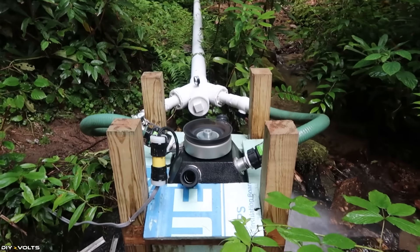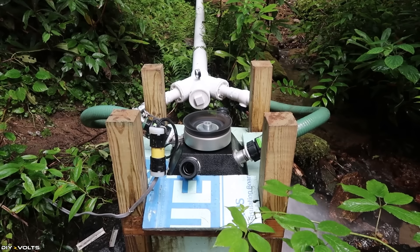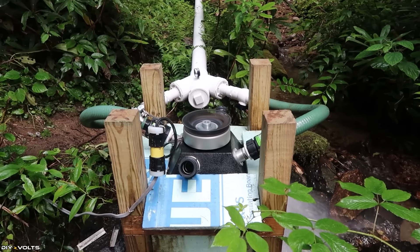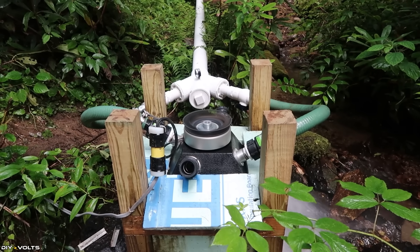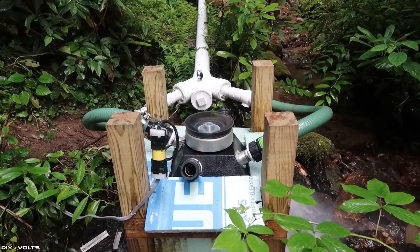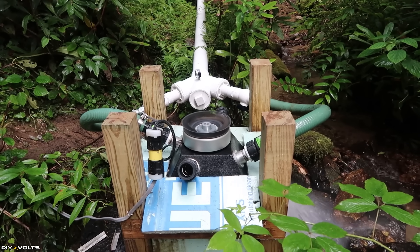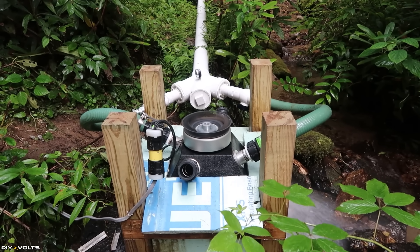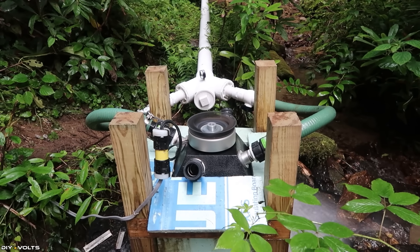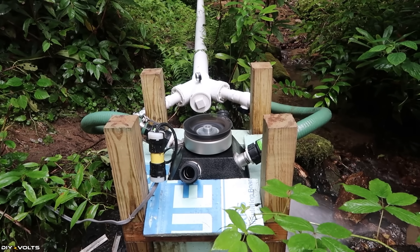This is my turbine — it was built by Spencer Langston and it really works well. I went through a fairly lengthy process of checking different nozzle sizes in this split hose setup and let Spencer know which ones work good with a 100% flow rate and still have overflow with the intake, which is really important — I don't want to dry the creek up.